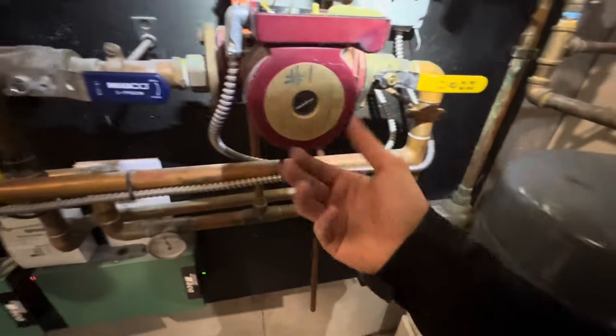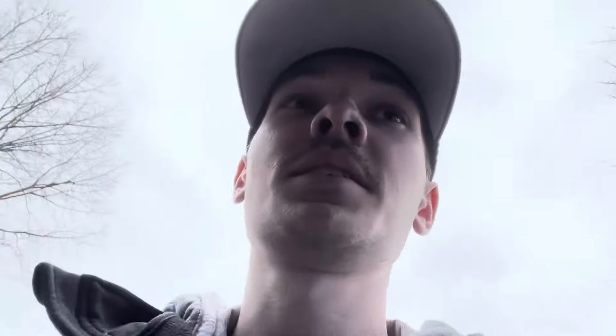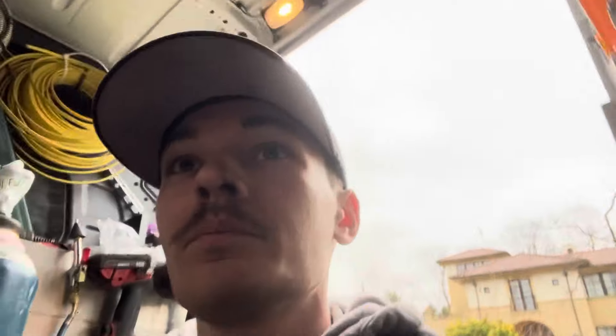Let's see what difference we get when I change out this circulator — and also that zone valve we've got to change. I had a little bit of a tough time with the customer because I told her that circulator pump is bad, and she said someone was just here and replaced the radiant pump. But they replaced a different pump that I don't think has anything to do with the radiant. I told her I'd like to replace both pumps — it looks like one is a backup — and they're both making noises they shouldn't. Plus that zone valve. We'll take care of this.